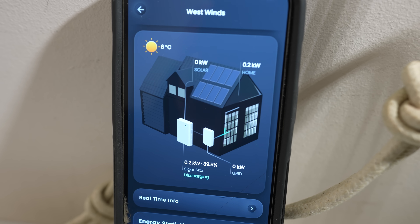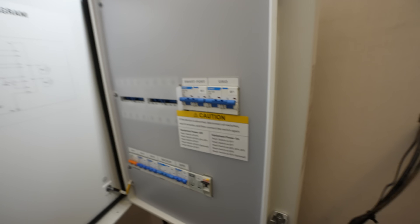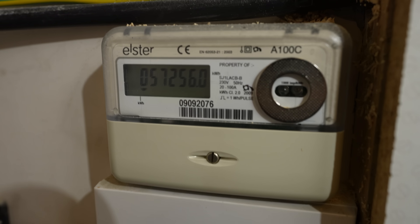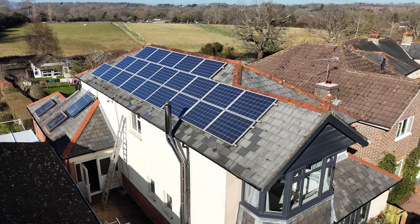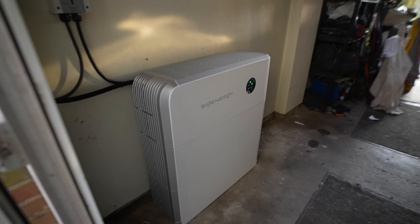It is the moment of truth. We're commissioned and up and running on the app — I'm going to switch off from the grid. When we go off-grid, I don't just want to see the lighting still running; I want to make sure our existing FIT tariff solar install is still running, because that's the key thing. We switch it, we're going to hear the contactors click out — there we go. Lights didn't even flicker, and solar still running, mate. That's pretty cool. We are running off-grid — the sun is charging us up off-grid with a third-party inverter. So if you have net metering, want battery storage, want to function off-grid but don't want to splash the cash on a whole new inverter or electrical system — you don't need to. Give us a call, we'll be happy to help. Thanks so much for watching, don't forget to like and subscribe.